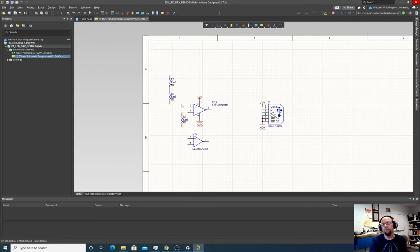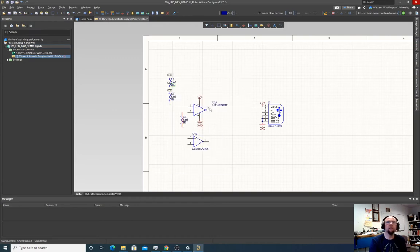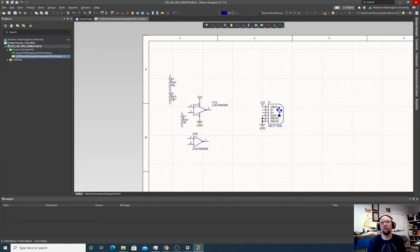So let's do like we did in lab and do a voltage divider of 1 volt. So with a 5 volt source, a 1 volt voltage divider would require a 4K and a 1K. Let's make it a little bigger so we're not wasting too much power. Let's make it a 40K and a 10K. So I'll make the top one 40K and the bottom one 10K. And again, all we're doing is changing this as a note for ourselves. So we're just changing this to tell ourselves, hey, when you place this, this resistor has to be a 10K, this one has to be a 40K.